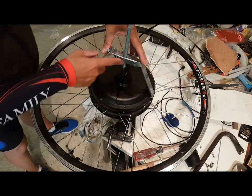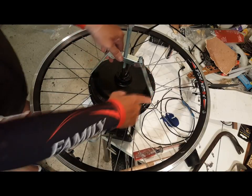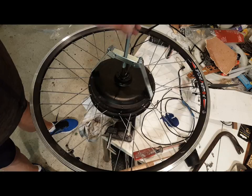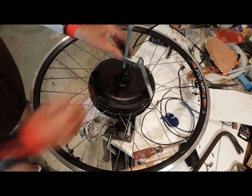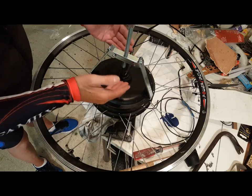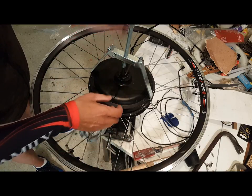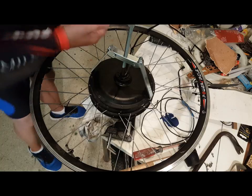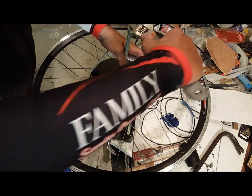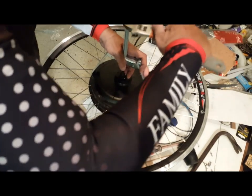For the final step, what you're going to need is one of these — a gear puller. They come in two or three arms and they're adjustable. This is an eight-inch puller. They can be as expensive as $30, $40, $50, up to $100. I bought this at an automotive store for $9 and it does the trick — it's just two arms. The problem is that this last part is very stiff. So after we've done some prying and hitting it with a rubber mallet, we're going to torque it a little bit. I put a little bit of Teflon oil down here along the bearing, then give it a few strokes and it should come right off. I'm just using a crescent wrench — you can use any kind of wrench you'd like.